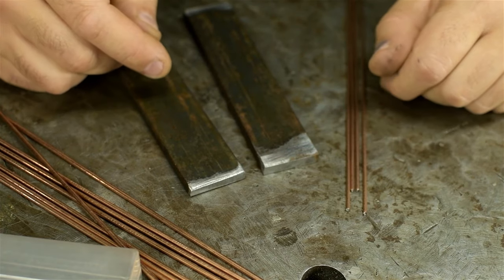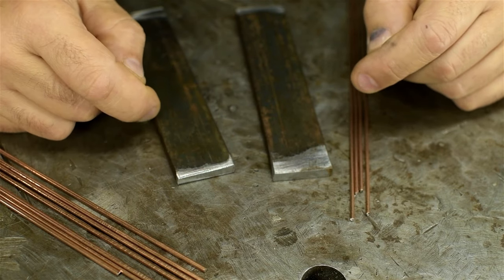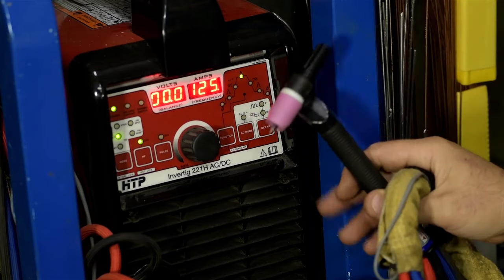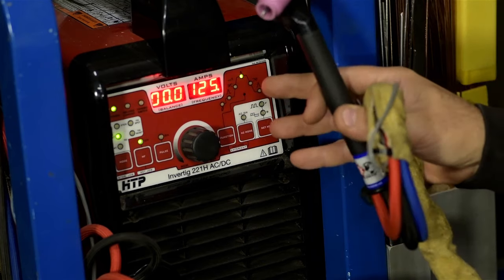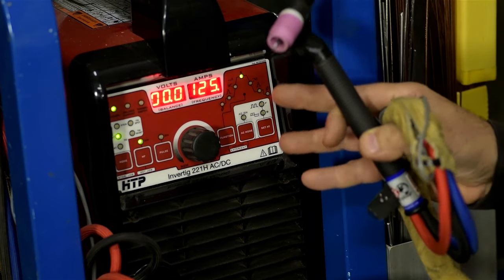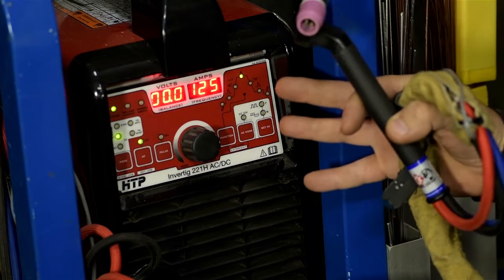I was going to compare a tool steel edge built up with this welding rod to a mild steel edge, but maybe we'll compare it to a regular welded edge with ER-70 so no one calls me out on it. If this stuff is as cool as they say, let's build up a tool steel edge, sharpen it, and see if we can cold chisel some steel. For comparison, I'm going to make a second one with ER-70S. Nothing particularly fancy about welding these — DC TIG, 100% argon, set to about 125 amps, foot controller attached. I'll probably start there and salt to taste. I want the weld material to stick, but I'm building up an edge, not driving it in.